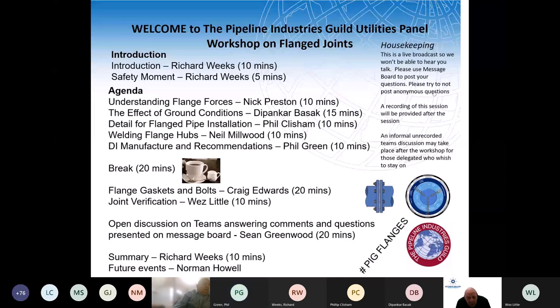So Phil and I will carry that chat forward and validate, obviously, installation torque values pertinent to the gasket type and the application. I think it's safe to say that the installation torque values that Saint-Gobain have got work great potentially on ductile to ductile, but we've got other combinations in there as well. So I think that's probably worth the validation, as a lot of these flange types have potentially moved on since the original validation was done. Cheers. Yeah, I agree with that.